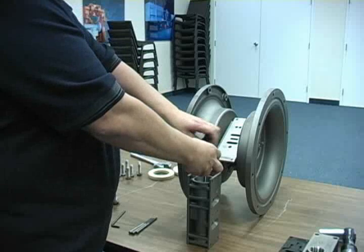Please note: the air valve spool should not be left out of the bore for a prolonged period of time, as the polyimid cap seals have energized O-rings underneath them. These cap seals can swell and may be damaged upon reassembly. Apply a generous coat of lithium-based grease to the air valve spool seals during reassembly.